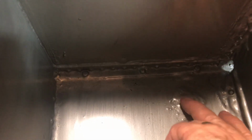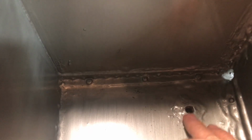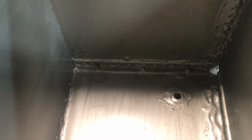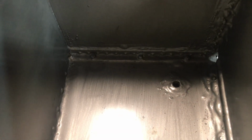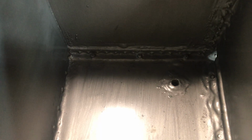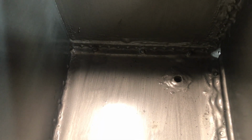If I don't need to do that, then another alternative I've got, and I'm glad I built this in, I built in a drain here in the tender, and I don't know if you can see that or not, but it is threaded. It's a brass drain that I machined myself years ago. It's just sealed around here with the POR 15 compound, but it's basically just a low point drain with a ball valve attached to the bottom side of it over there. And so that's another alternative. I could always run the water lines out there through that if I wanted to leave this stuff untouched.